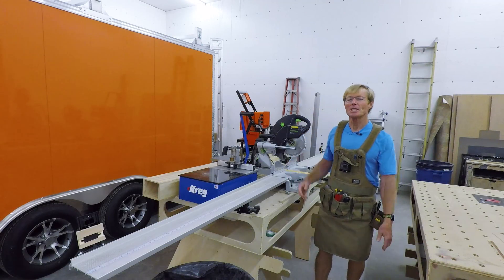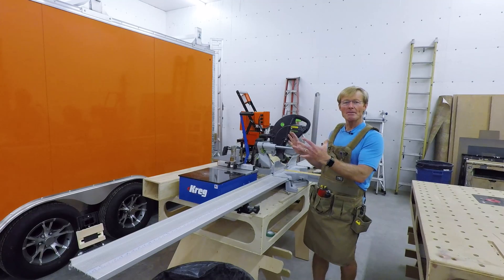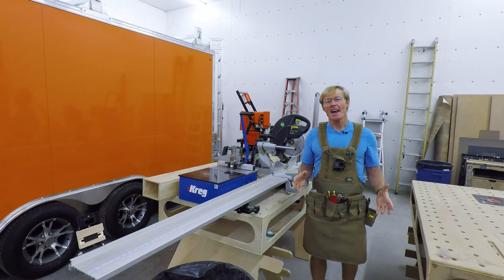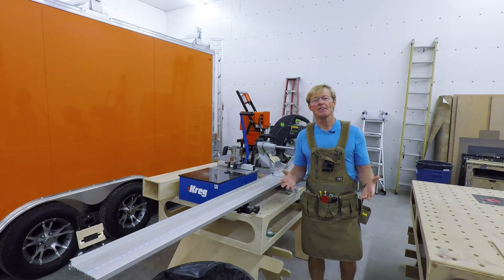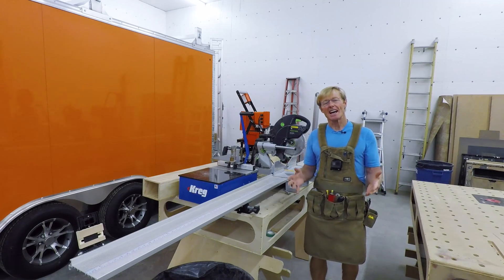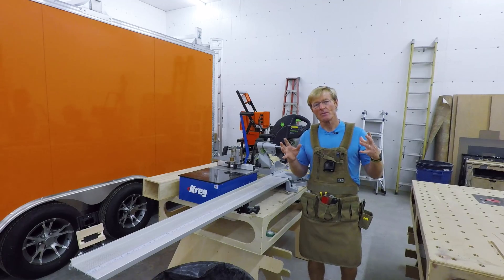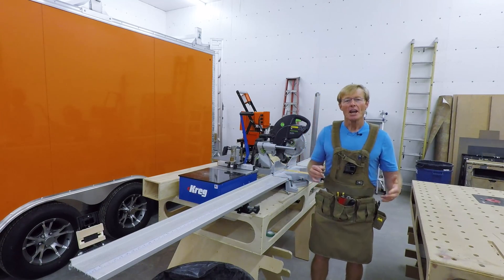Hi, I'm Ron Palk. I'm down here in this space working on the Smart Woodshop. I've got all of the cabinets in and most of the detailing done, and now I am into a production phase where I'm cutting up the half-inch bases of the drawers, getting them all roughed out, and then once that's done, I'll set up for the dados, and I'll be building a couple of jigs for cutting out the notches.